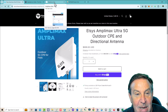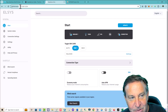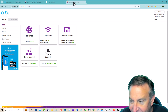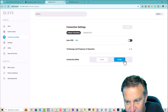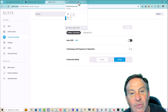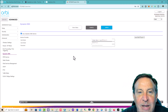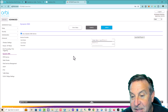When you get it, you'll be able to put it into different modes like bridge mode. And you're still able to access it using a static address without having to reconfigure it. I'm plugged into my router at the same time — I don't have to disconnect things. In bridge mode it'll grab the IP address from T-Mobile. Going to advanced settings, there is an option for DDNS, which lets us solve the carrier grade NAT issue and serve things using No IP — it works beautifully.